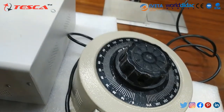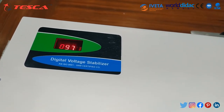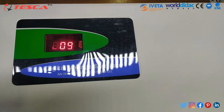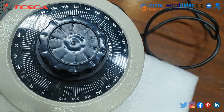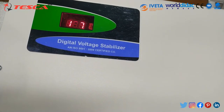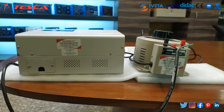When I set the voltage to 100 volt, you can see that the output is 214 volt and its input is 98 volt. When I set the variac to 140 volt, the output is 208 volt and its input is 137 volt. And when I set the variac to 170 volt, the input is nearly about 167 volt and the output is nearly about 212 volts. In this way you can note the readings at different points.